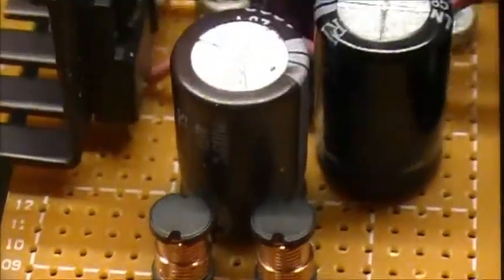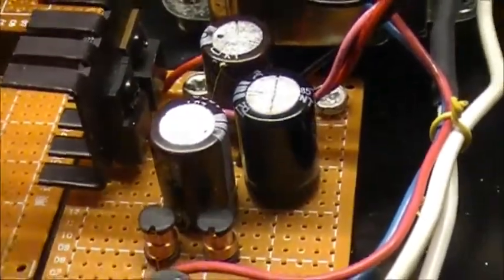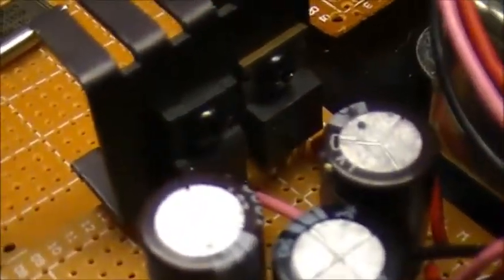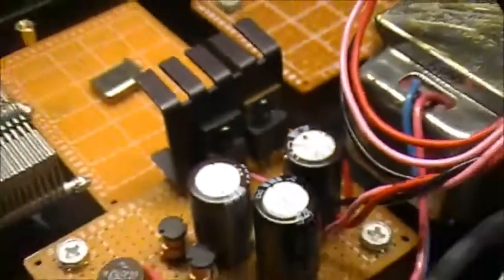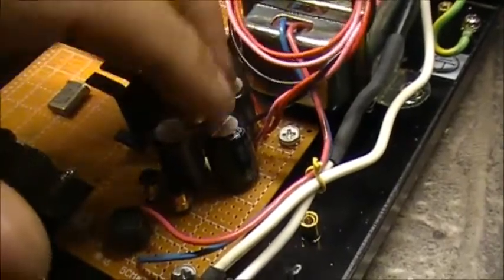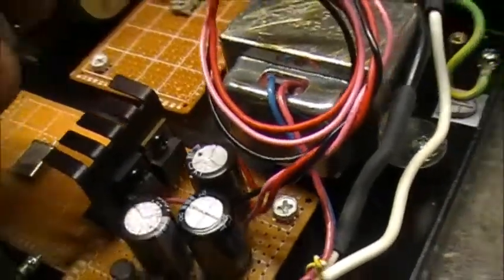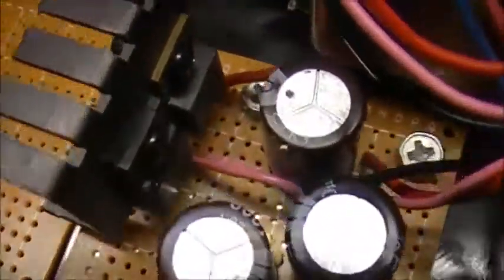I've got the DC going through two inductors, which goes through a capacitor, and then the voltage from there goes into two voltage regulators — an 8-volt and a 12-volt regulator. The power from those dumps into two electrolytic capacitors here, and the ground is common. I'm using pink for the 8-volt and red for the 12-volt, which matches up with what comes after the regulators.